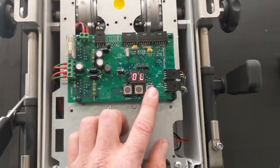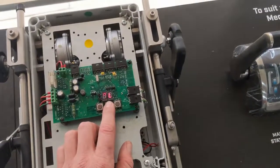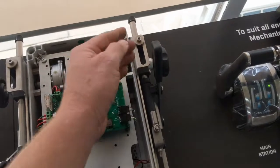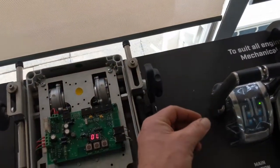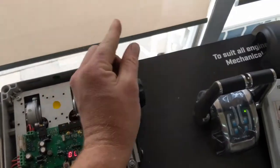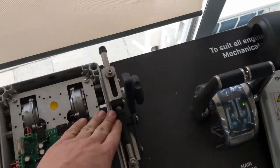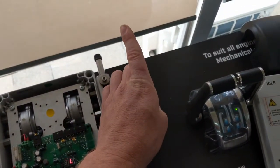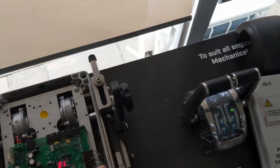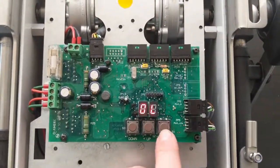We press enter to make OL flash and then move our lever to the reverse position. With the Morse cable connected, make sure it's disconnected on the gearbox. Click the mechanical lever on the gearbox to where it needs to be and line up the Morse cable so it's not putting excessive tension but has properly gone into the detent — the last thing you want is the selector to not quite be in the detent. Once you've found the right position for gearbox reverse, press enter.